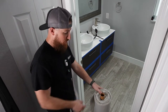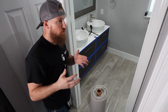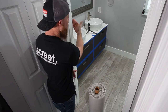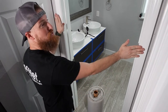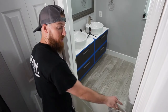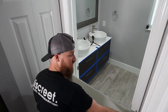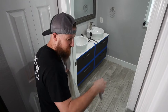When setting up the containment barrier — this plastic sheeting — we're going to go to the opposite side of where our suction is going to be. We're going to have our workspace under negative pressure, which means everything outside of our workspace is going to push in. Rather than tape the plastic to the inside of the doorframe, where enough suction will just pull it down, we want to tape this to the outside of the doorframe. It's better to cut a little more plastic than you need than to not have enough — I always like the rule of about three or four fingers extra.